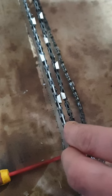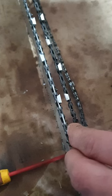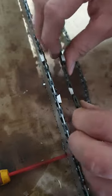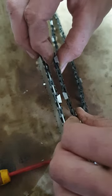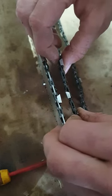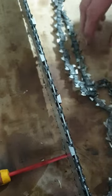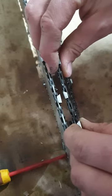So there's your difference between semi chisel and full chisel skip tooth. Skip tooth means two teeth are missing — they replace two with one. The full chisel has very sharp points but they blunt fast, so don't hit dirt at all or you're screwed, and avoid rotten timber as well. That's the difference between semi chisel, full chisel, and skip tooth.